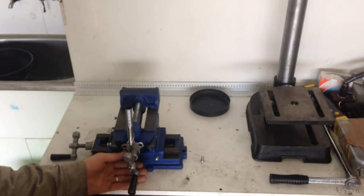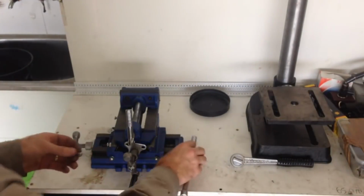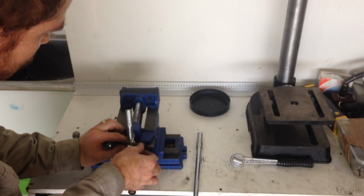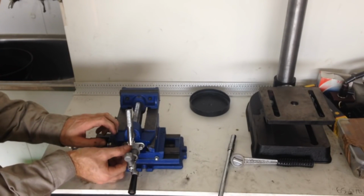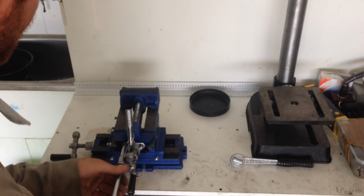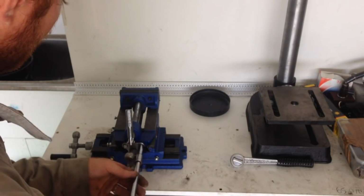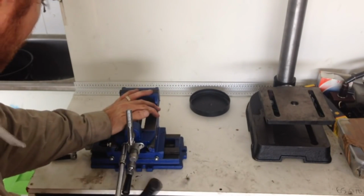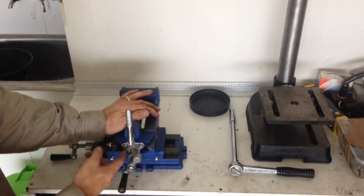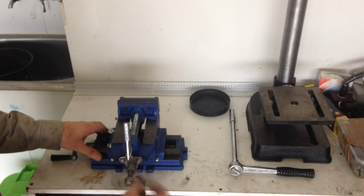Now we're going to put our screws back in. These are M6 by 1mm pitch thread, so that's what you need to tap in the casting. I've just added some spring washers there so that we can keep it tight so it won't rattle around. Just going to start by hand. And in we go. Just don't lock them up completely tight before we start the operation of it, because there is going to be some play in this thread and we need to see if it's going to work freely. Which it does. So that's nice.